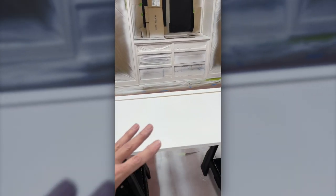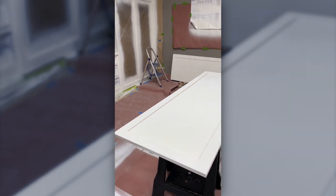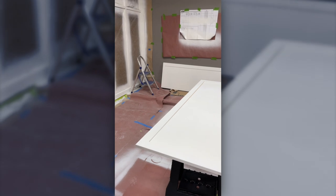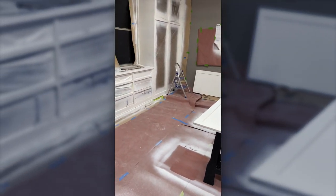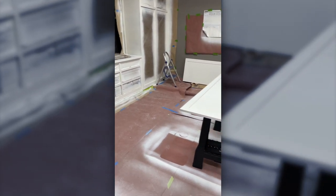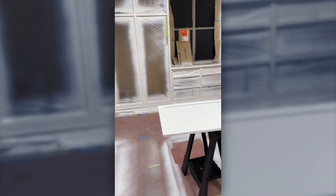I think I'm just going to leave the inside of the doors primed and only paint the outside faces, because the paint takes four hours to dry and I won't have enough time to paint, let it dry, flip them, and paint the other side. I've only got one day to finish this because temperatures are going to drop — I need to be painting in 50 degrees or above, and it's going to be 65 today. I will update you tonight on how this project is proceeding.